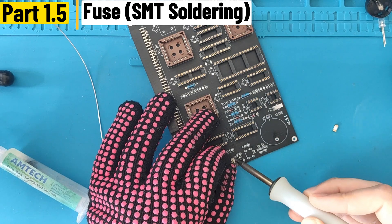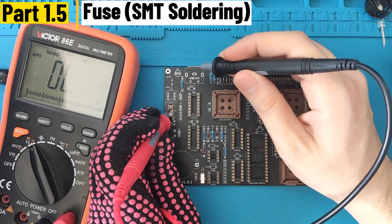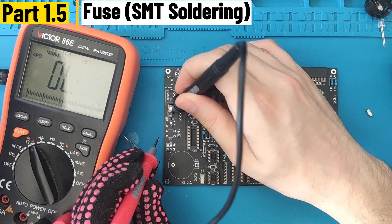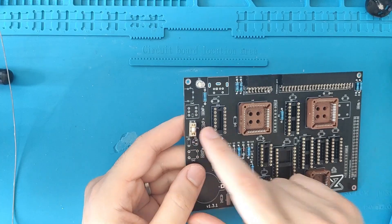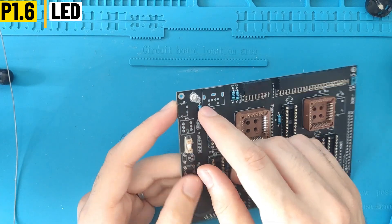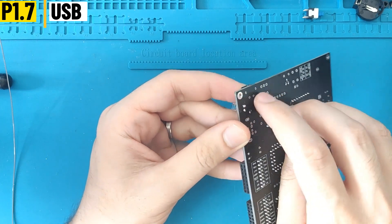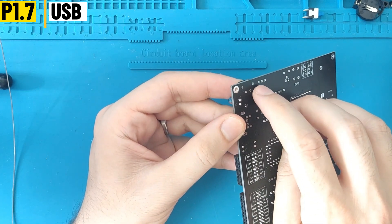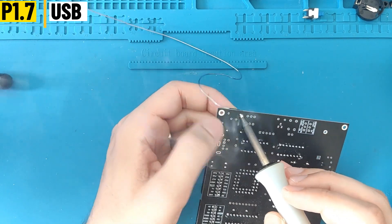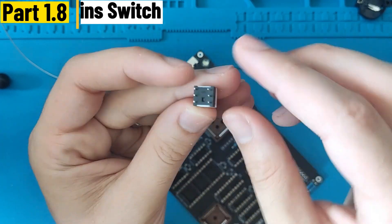Just take your time, and afterwards you can check whether you soldered it properly using a multimeter in continuity mode. After installing the fuse, solder the LED — be careful, the LED has a direction, after all it's a regular diode. Then comes the USB-C port: the legs are quite short, so you will have to put some solder inside the PCB.